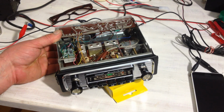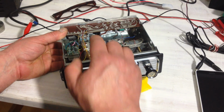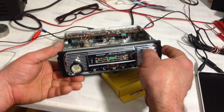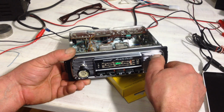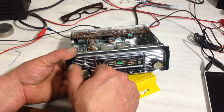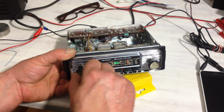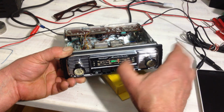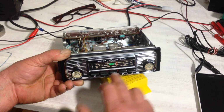And it's not standalone, and basically what it does, it sniffs the frequency of the local oscillator of the AM, and that means that the radio must work on AM, it must work perfectly, otherwise this FM conversion isn't going to work. And to switch over from AM to FM, you turn the radio off quickly and back on. And now we're on FM. Sorry, it only works if you have it on AM. Not long wave, not short wave, only on AM.